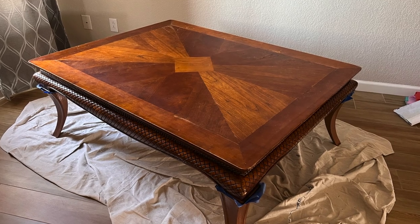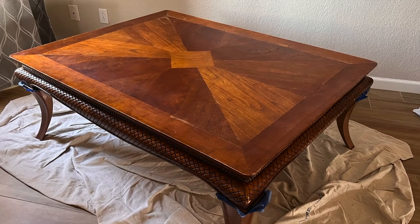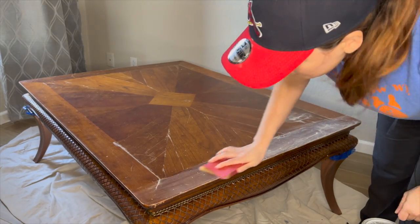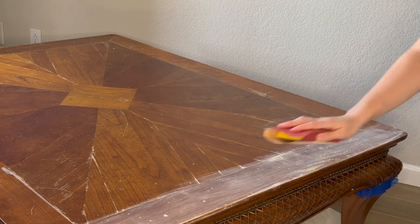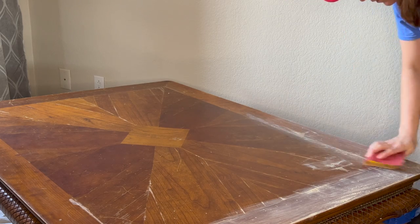It's okay to repeat this process, and after that I thoroughly dried it and used a piece of 180-grit sandpaper. It's important to sand with the grain of the wood and I only did a light sanding, so not a lot of pressure was used.